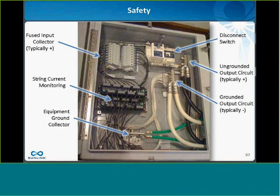And so the voltage and current from the other combiner boxes in the system will backfeed this point. And I've gotten caught by this before myself, and it was not a fun situation. So just be careful. If you open up the switch, it's quite likely that neither side of that switch is actually disconnected from voltage. The only way to avoid that is to go down to your sub-combiner and pull the fuses out of there and open the switch to isolate that output circuit.